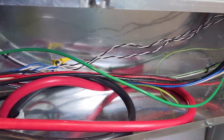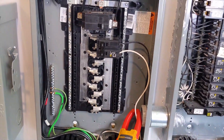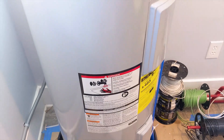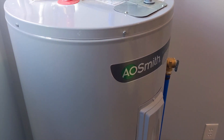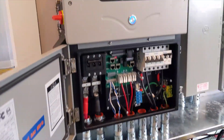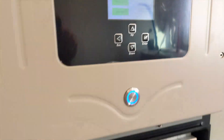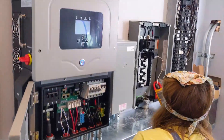You can see all our mess — DC and AC aren't separated yet and we need to vacuum. You're seeing how the sausage is made. There's the load on the water heater element — you only want to do this during the day when you have plenty of solar. In theory you could heat this tank three times over; it takes about 8.8 kWh to heat a 50-gallon water heater from well water temperature up to 120 degrees. That's day three — we've pushed new software updates to the SolarArc, batteries are charging, and we're connected to our Wi-Fi router.